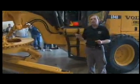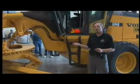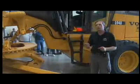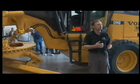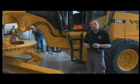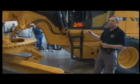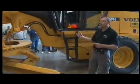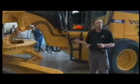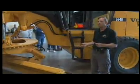In order to check to see if your signal lights and brake lights are working, you should have a helper. If you don't have a helper, try and back it up close to a building where you'll get the reflection. Okay? Once I've done my brake testing, then I'm going to slowly creep forward and check the steering function. Make sure all the steering components are working well.